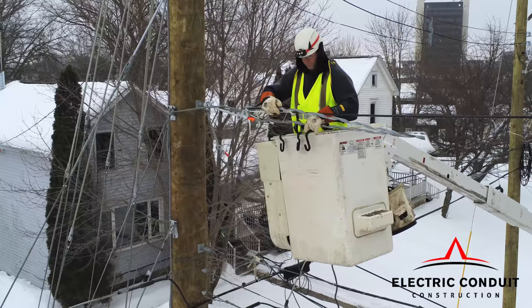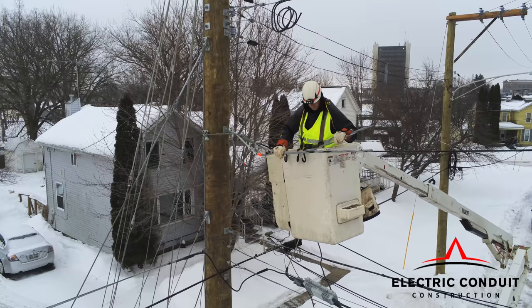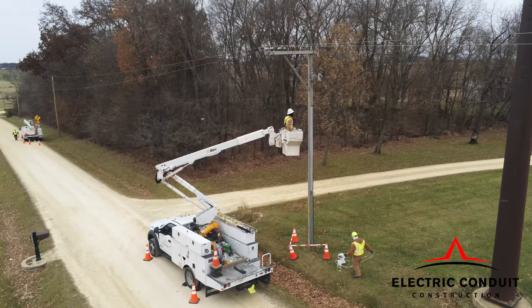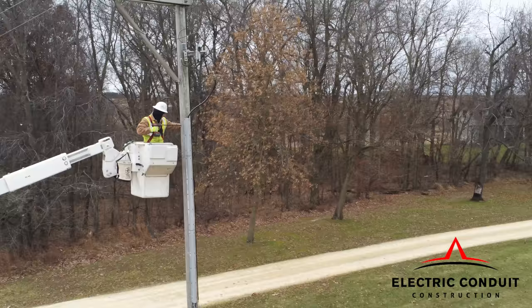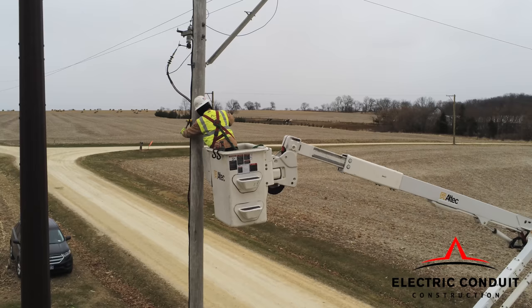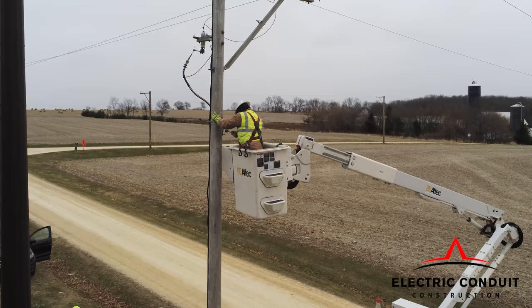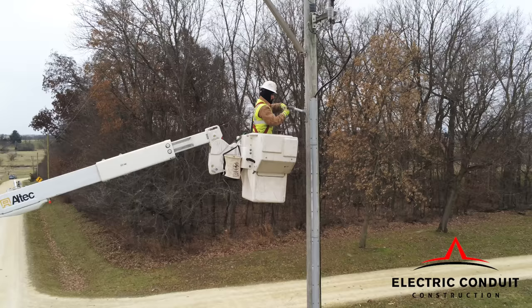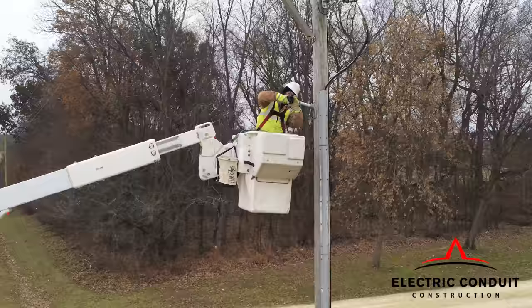Here you will note the installation of a preform on an ADSS fiber optic cable. That's an extension arm that he's installing, a fiberglass extension arm. We'll pull them out away from the riser pole. And he's putting on a tangent block, and then the grommet's inside.